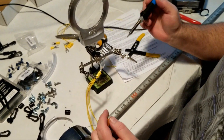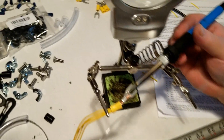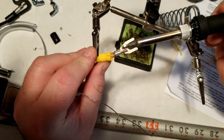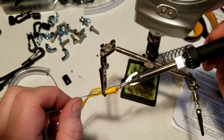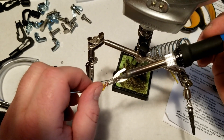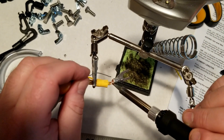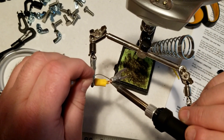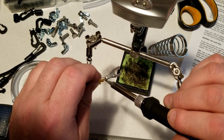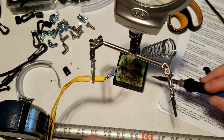Some simple assemblies going on here, some simple soldering — not a real high skill level. So if you have a little bit of equipment, or buy something inexpensive like that inexpensive soldering iron from Amazon, it's actually a pretty decent one — gets nice and hot and melts the solder well. Some cheaper ones don't get hot enough. There's plenty of choices depending on how much soldering you may do. You could use the wire that Callum provides, but I chose to buy some cheap wire to make sure I'd have plenty extra for elements. I'm using five elements currently and still have room for a sixth, and I have plenty of that D10 wire left. The D10, as we'll see with the elements a little bit later, is copper and steel — so it's a decent wire.